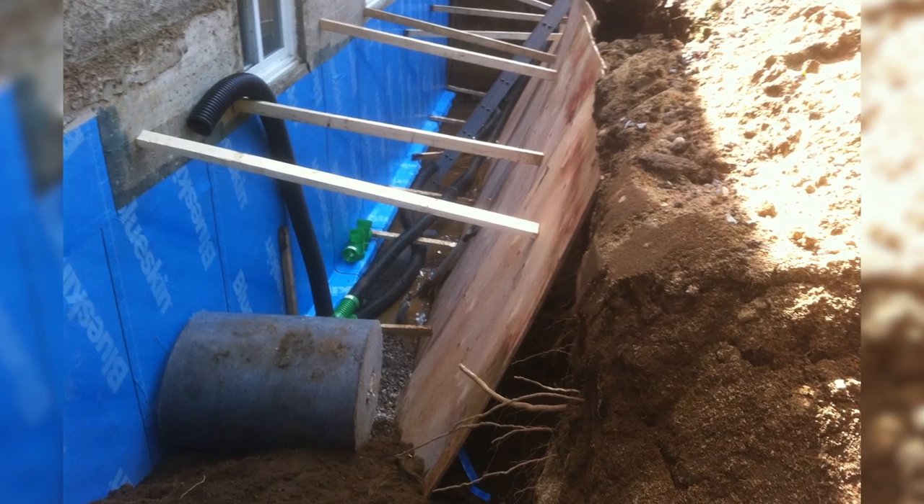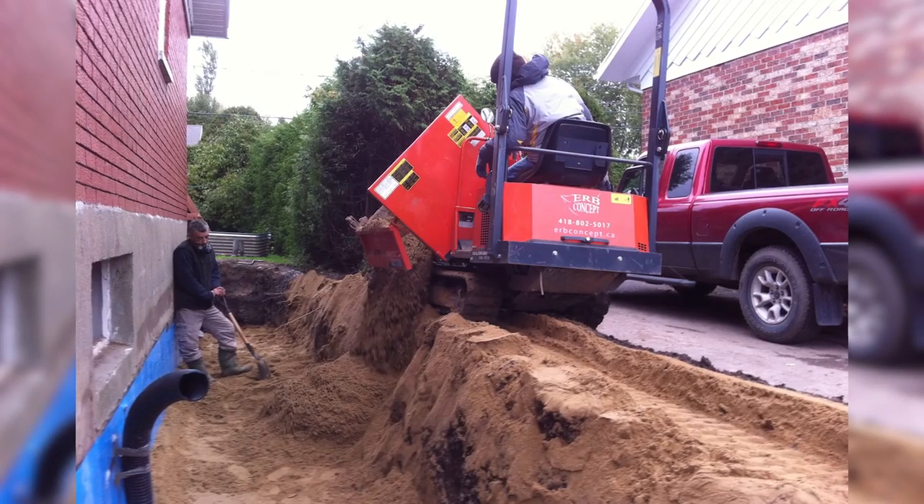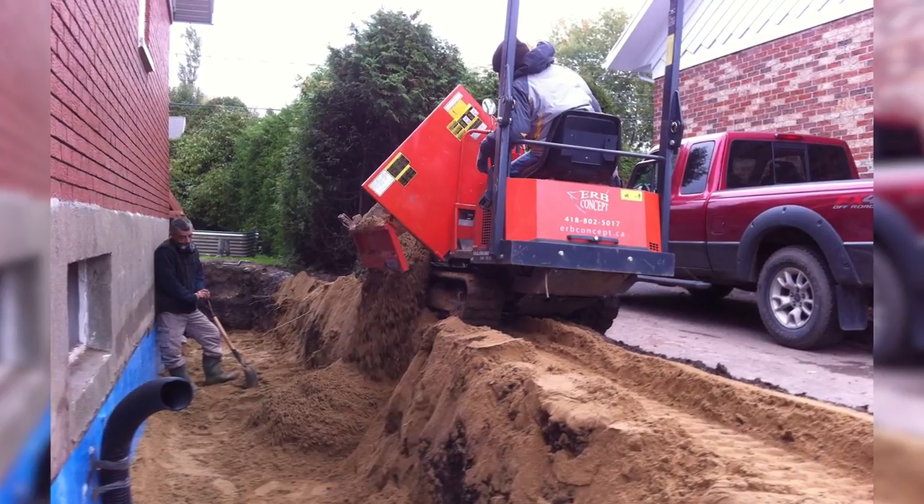You might also be able to direct water to the foundation drain. This type of drainage system can be found in most properties and leads water to the municipal sewage system or trench. Make sure to check with your municipality first, as this practice is actually illegal in a number of cities. Not to mention the problems that may arise if the drain gets clogged — water is likely to overflow, resulting in serious water damage in the basement.